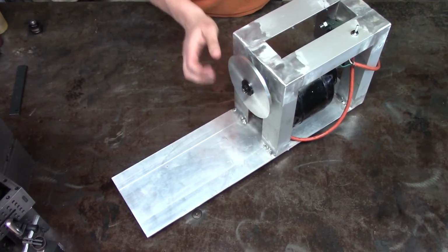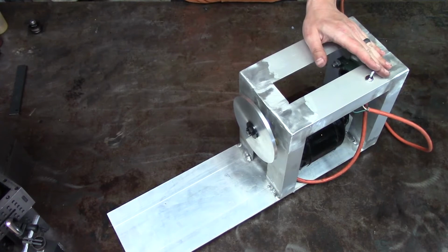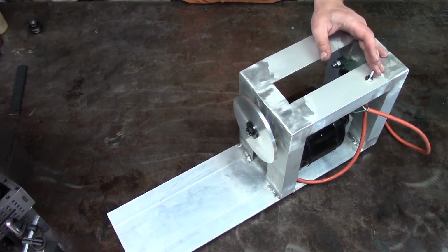There's no disc on here, just the backer plate at the moment. I did do some preliminary wiring on this. I'll take this all back apart, Loctite all the critical components, and paint this before it's finalized. Pull the switch towards you, turn it on, push it away from you, turn it off, so that if something happens, all you gotta do is hit that switch away from you, and it'll turn it off. And even though there is no belt tensioner, as this top spindle rotates pretty freely, it does turn without the belt being tensioned properly.